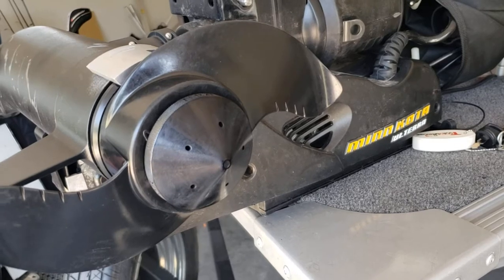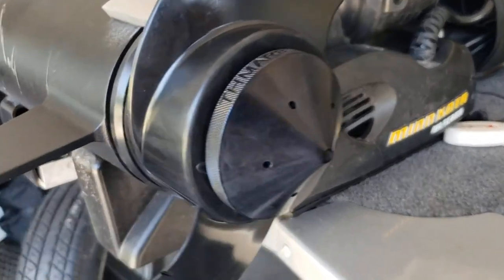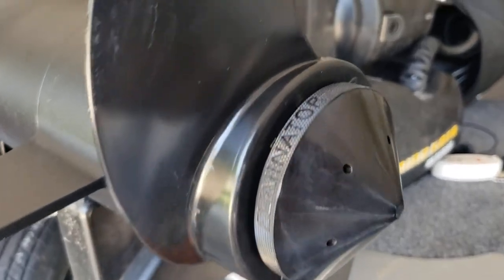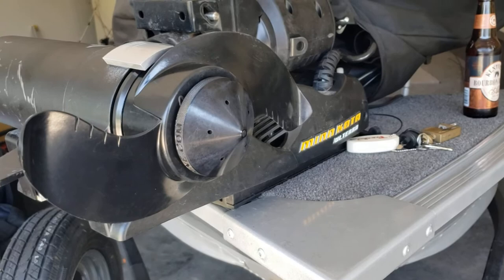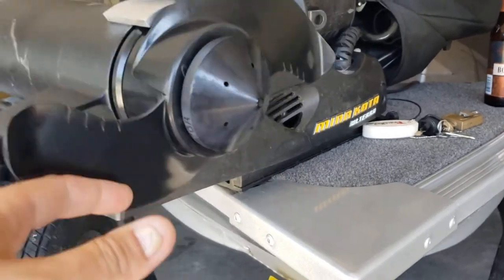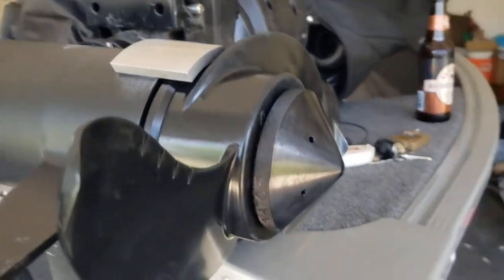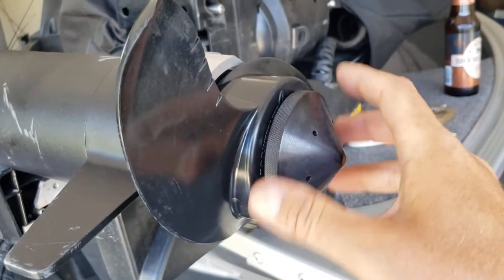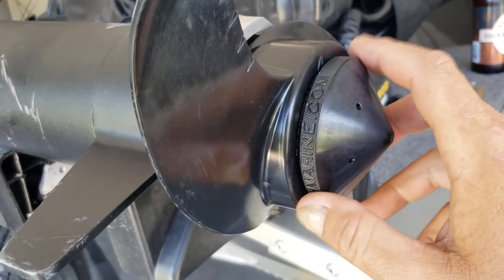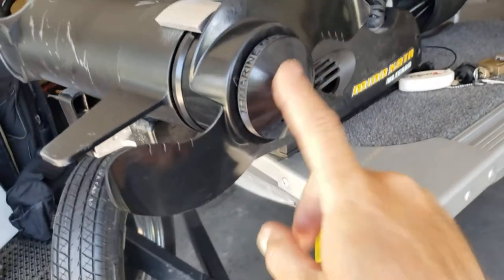In another episode you guys saw I had a wrench in the rod locker, and I said I didn't need it for changing trolling motor props anymore. This thing here is made by TH Marine — the Eliminator apparently. They bill it as some kind of harmonic balancer to eliminate vibration on your trolling motor prop. Honestly, if your trolling motor prop is vibrating, you either need to get it fixed or put a new prop on it. The reason I got it is because you can just grab this and unscrew the prop without any tools while you're on the water — you don't need a wrench.